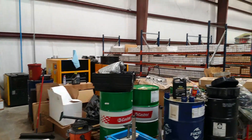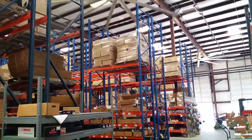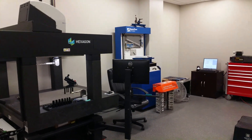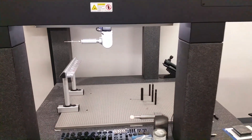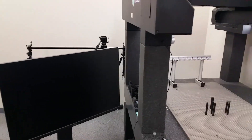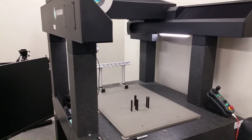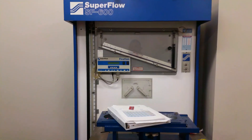This is the big warehouse — you can see cams, blocks, everything overhead. They've got a Hexagon CMM measuring machine. It's a digitizing measuring machine with a motorized arm controlled by a hand unit that allows them to measure all kinds of stuff. This is part of the process of getting cylinder head production fully in-house. The outside machinist who currently does the bolt holes and push rod hole finishing won't share his plans since they're cutting him out, so they need this CMM to measure their cylinder heads accurately, capture that data, and then plug it into the CNC machine to finish everything precisely.